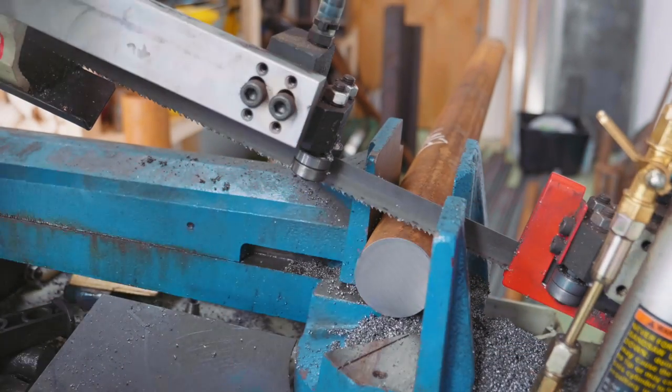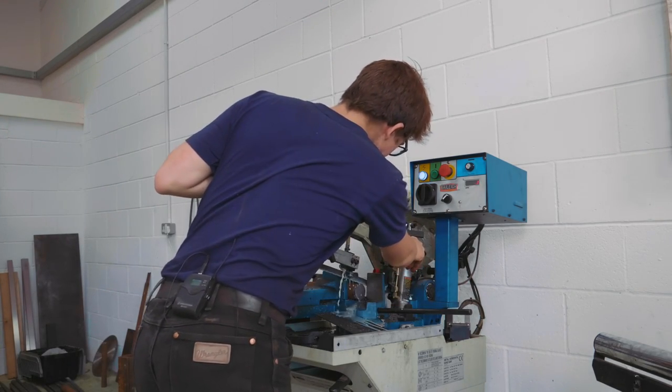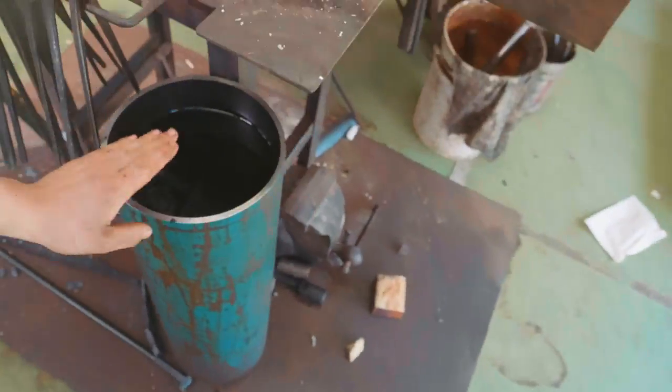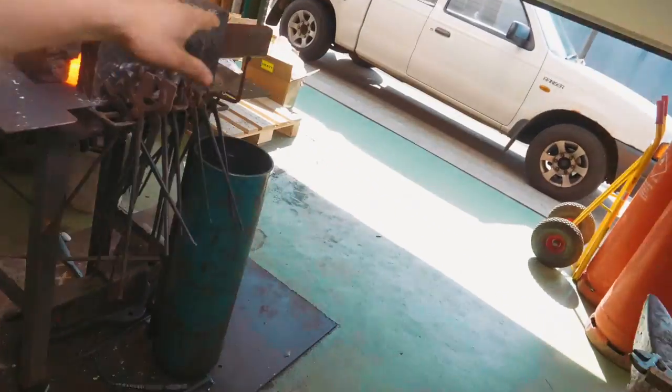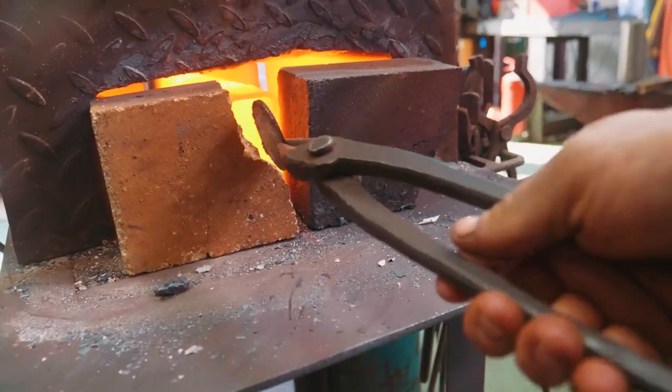As far as I understand, that's a very good thing. It's going to still allow us a lot of flexibility and suppleness that we definitely want in a sword. But the worry is that we don't get it hard enough to hold a keen edge. The oil you usually see me quenching blades in is equivalent to Park's 50 oil - a very fast quenching oil. You use oil for a lot of knife steels because you want it slower than water so you don't crack it. This is a low enough carbon steel where we could water quench it and it should be fine. Oil has the advantage of a more stable quench, allowing less chance of cracking - but that comes with the trade-off of maybe not getting hard enough. So with this sliver of steel, we're going to heat it up to the same temperature as the sword and quench it in the fast quenching oil to see if it gets hard enough.